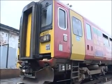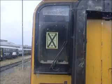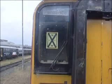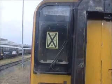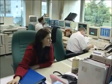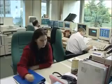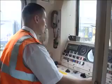When making an attachment to another unit, stop six feet short and check that there is no non-multi label displayed. If there is, it means you can't couple to this unit for technical reasons. However, you may be required to couple to a non-multi unit in a failure situation to render assistance. In this case, get technical advice from control before you do anything else. If all is well, draw up and stop two feet short.